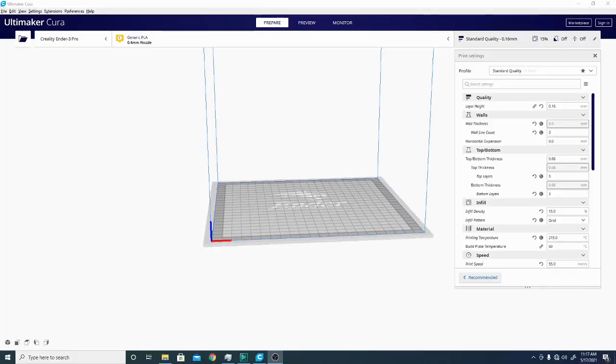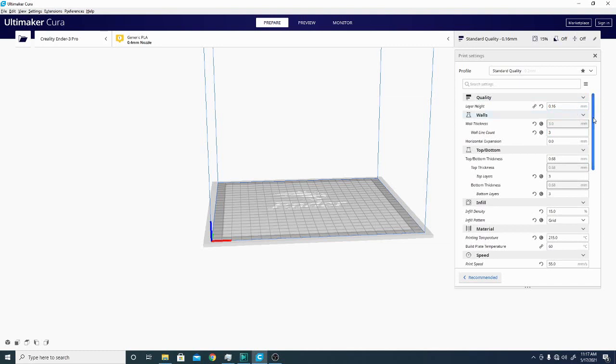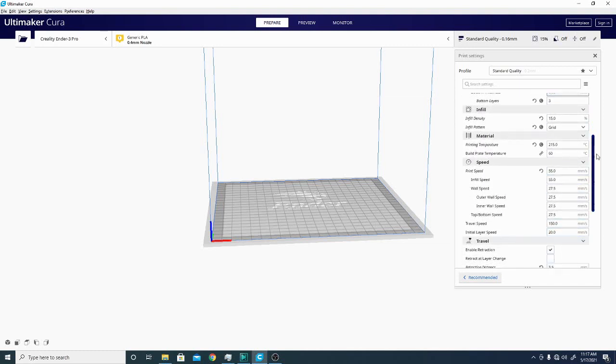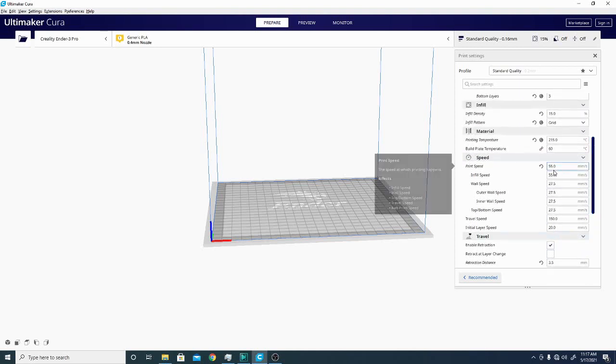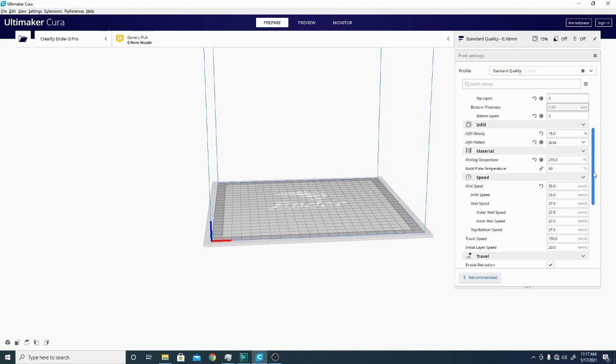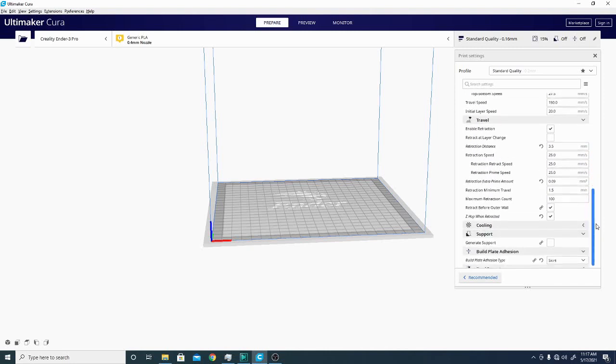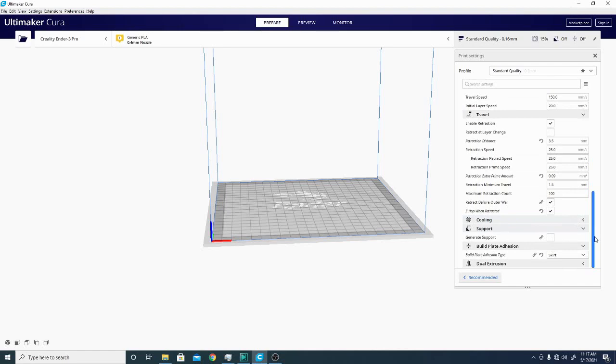A quick note about our settings today. The point of this video is to compare these two printers and see which is better for ease of use — that means plug-and-play ability, just plug the printer in, type in as few settings as possible in Cura and get a decent print. We are using pretty basic settings and a generic profile: 0.16 millimeter layer height, three walls for the line count, and print speed running at 55 for the multi-test. It was at 100 for the engine test. The Artillery Genius did print a lot faster at the same speed settings than the Ender 3 V2, but whether that's a positive thing remains to be seen. Cooling settings: we are printing white PLA on both, so obviously the fan is on.